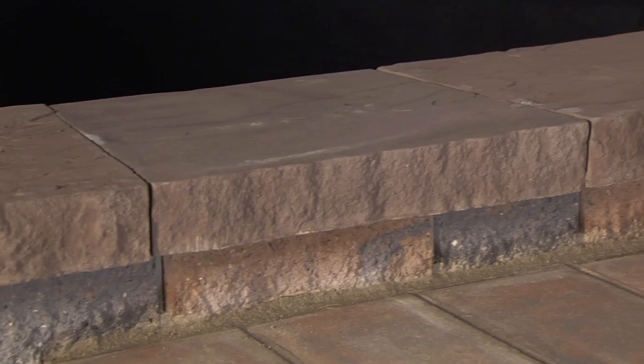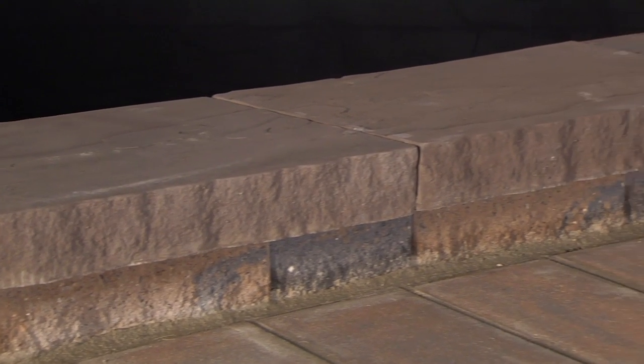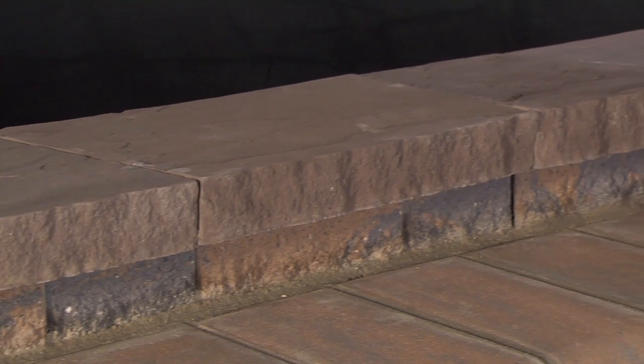On the last step, we have installed our ledge stone cast stone coping. Notice the corner unit is faced on the 90-degree side already — perfect for this application. The use of a mortar joint versus placing the units adjacent to each other is customer preference. Both are correct ways to install bullnose.